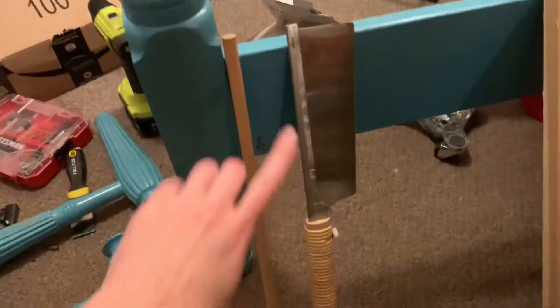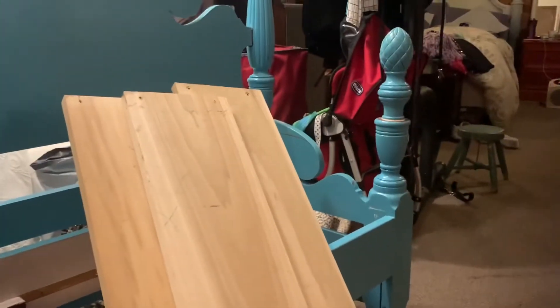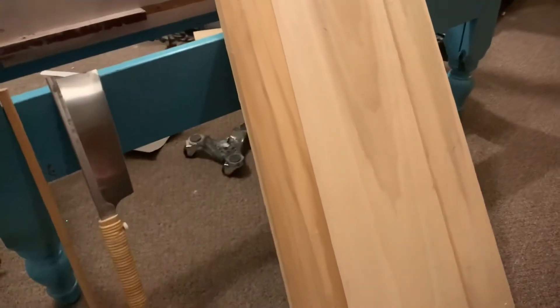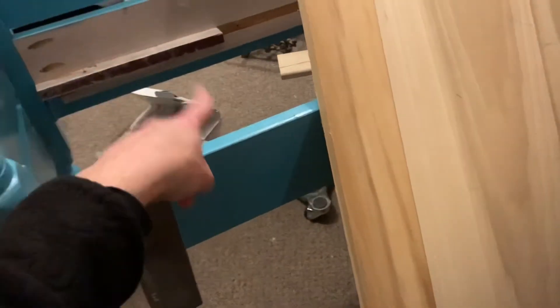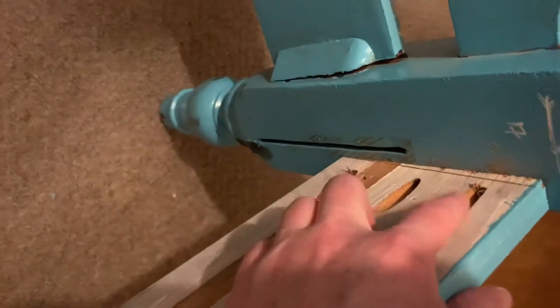Here I used a half-inch dowel and a half-inch drill bit on the top and the bottom, glued them together, and those are good to go — they look perfect and work really well. Then I'm going to cut all of these boards down to fit the bench. I've used pocket holes to attach the whole frame together and they worked really well. It was my first time doing it and I highly recommend them — they were super easy and I did all of them by myself.